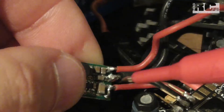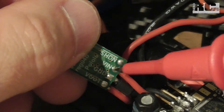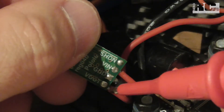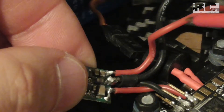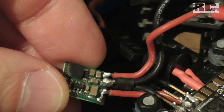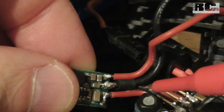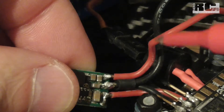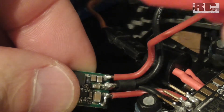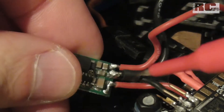The wiring is pretty simple. V-in comes directly from your flight battery — 4S, for example, which is normal on a race quad. Ground also comes from your flight battery, and V-out is the red wire which goes to your VTX to deliver the clean power from the step-down regulator. The ground pin is shared for both power in and power out, and the V-out line can also be split to your FPV cam to get clean power to both the VTX and the camera.